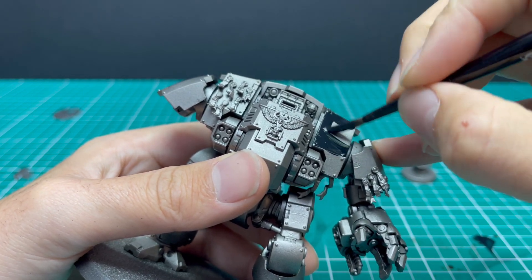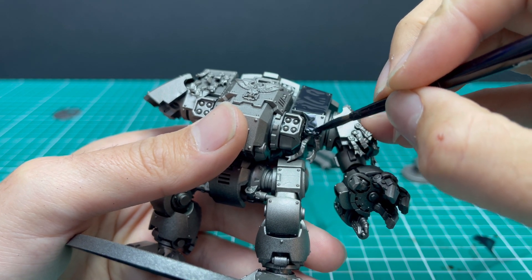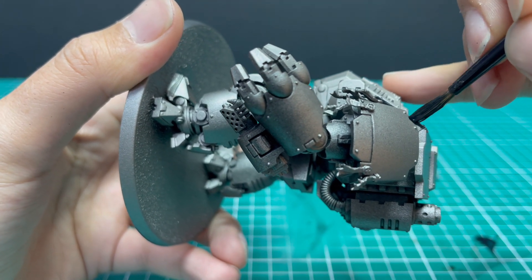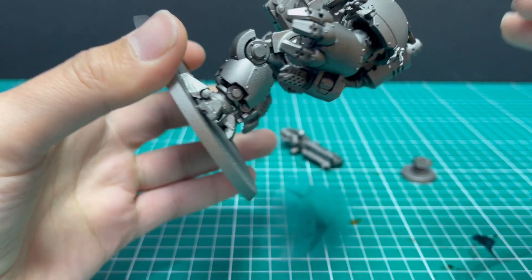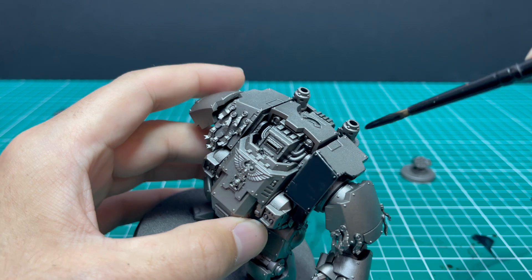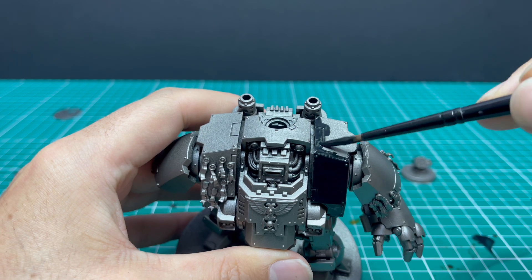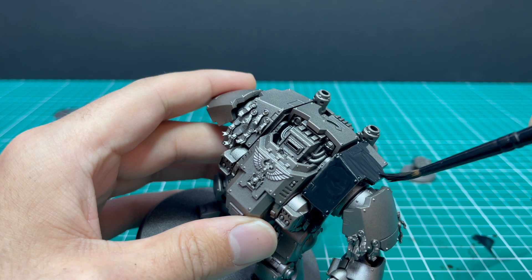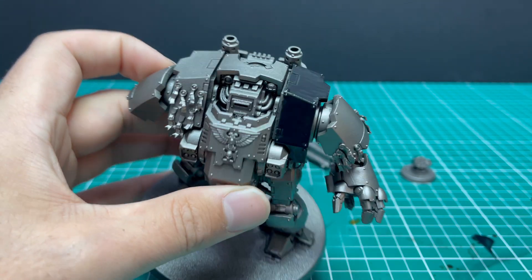You can see I'm basically blobbing it on, which goes against everything a painter is taught to do — brush control, thin coats, all of that. But you basically want to give it a pooling coat, and then give it its own time to settle down, stop all the brush strokes forming. It will give a solid black coat if you just give it its time. Make sure you complete an entire panel before any part of it has dried. You want it all to blend together — you don't want a dried section of contrast going on to a wet section, as they'll leave a horrible line between the two.